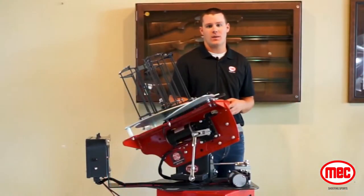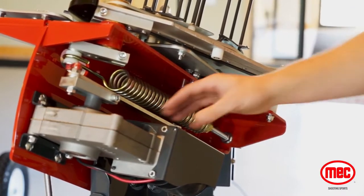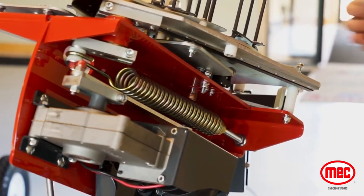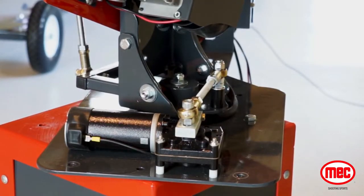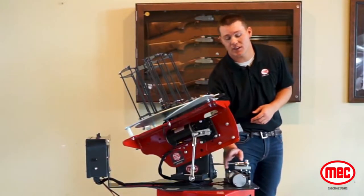Another key feature that comes standard with the Mech 100E Wobble is the motor cover. This motor cover was designed to prevent water from being able to get in between the gearbox and the motor. What this does is improve the longevity of the motor and gearbox, keeping the internal pieces from corroding. For both the horizontal and vertical movements of this machine, there are two motors and gearboxes — one placed on the base and the other on the side of the mainframe.